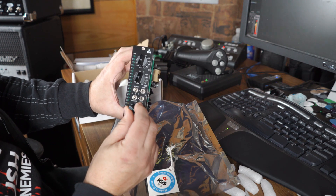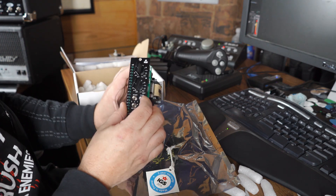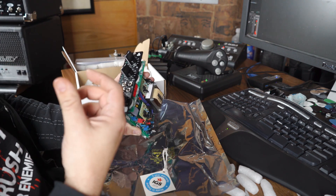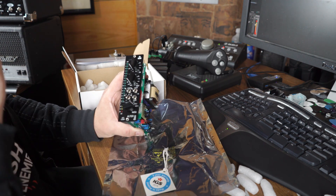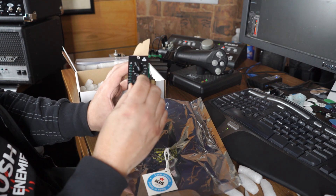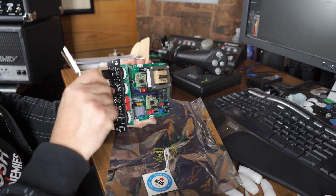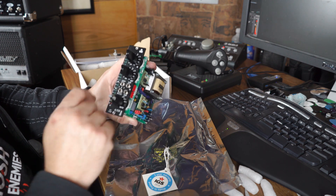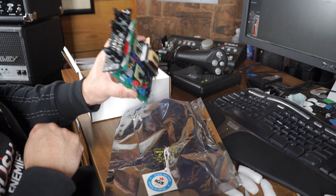Check it out. We got our ratio on the bottom, everything from 1:1 to 20:1, plus the slam switches — that's the old put-all-four-buttons-in trick on the original 1176. Attack: slow, medium, fast. Release: slow, medium, and fast. So if you're doing snare drums — fast attack, fast release, that kind of stuff. And your in and out controls, and they're stepped. Look at that — a nice solid feel to these. Great big honking transformer. Beautiful stepped switches. Nice, solid feedback. Great big meter on the side to show you how much gain reduction you're getting. I can't wait to plug this in and try it out on a snare drum.